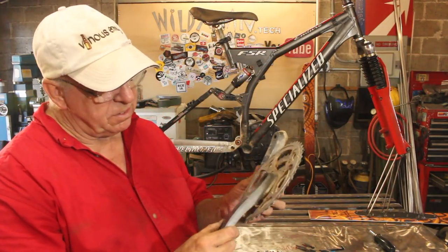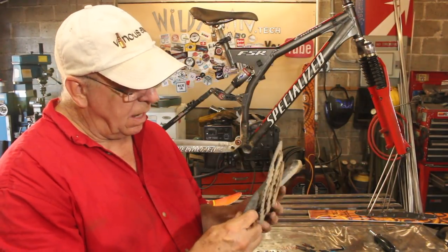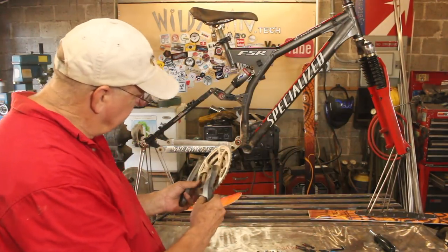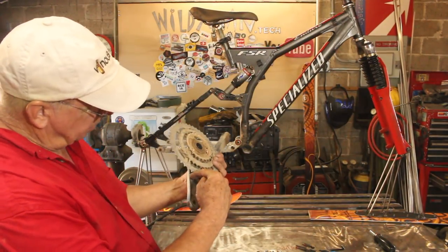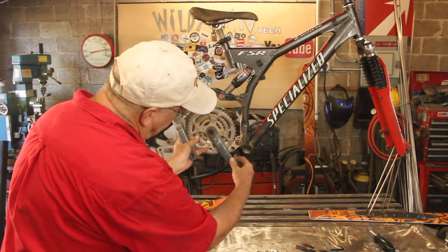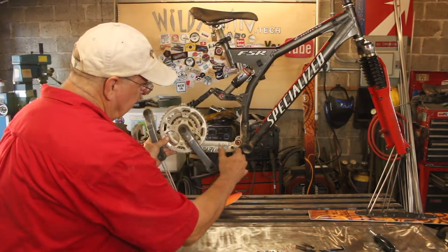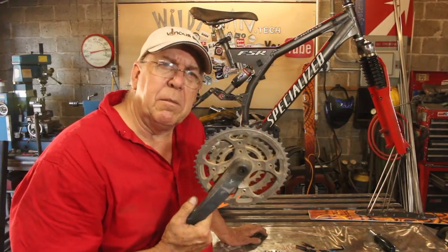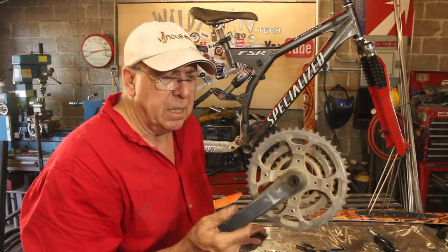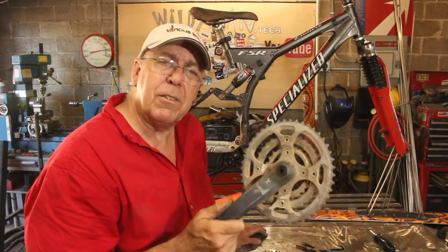Here's the crank that came off this. It's a Shimano XTR, which is a pretty high-end crank. I am going to cut these ends off of it and just use a hole saw to mill in a circle there that matches the bottom bracket, then we'll bolt these on through there with a bolt. We'll just put a standard set of pedals in there and friction will keep them in place. I know a lot of people think it might be some sort of sacrilege to cut up a perfectly good XTR crank, but this thing is never going back on a bike anyway. I'm repurposing it and saving it from the recycler.